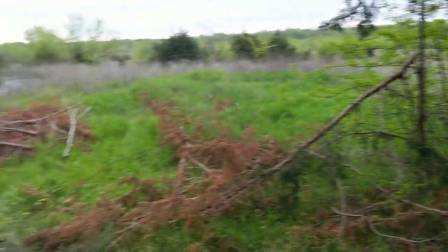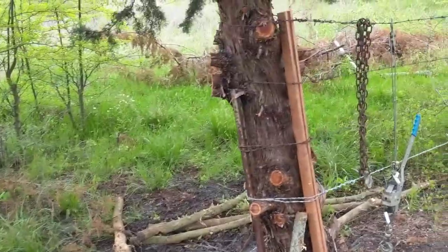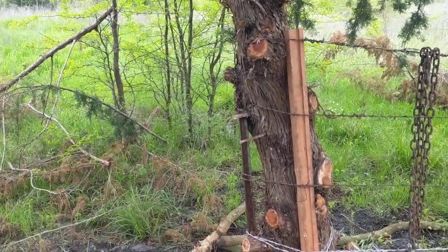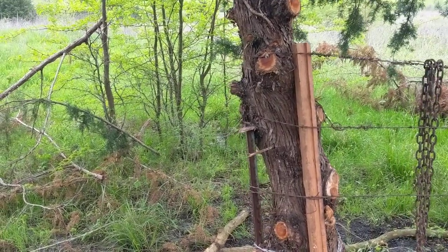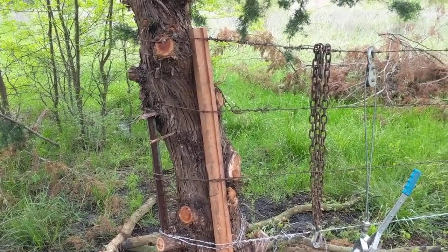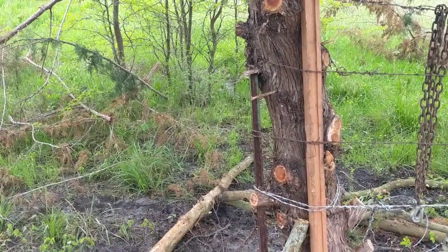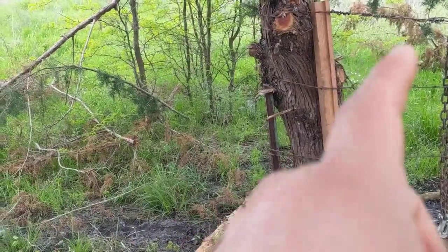So I'm going to create a wire gap here. Instead of pulling wire from that corner brace all the way to the other corner, I put it on this cedar tree that was right along the fence line — that's what these trees get for being in the way. I tied on that one and put a board in there so the wire doesn't eat too much into the cedar. Eventually it'll get eaten, but the tree will be fine. It's an excellent way to avoid building a brace, because with this clay soil, digging is just nasty.